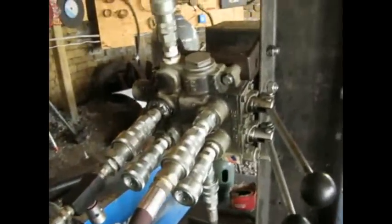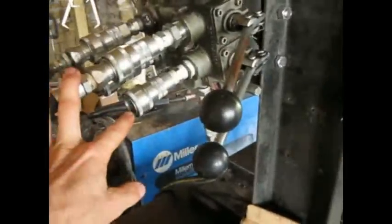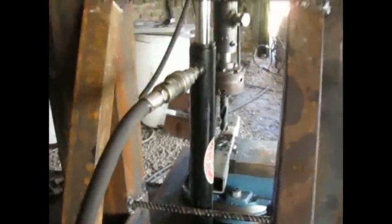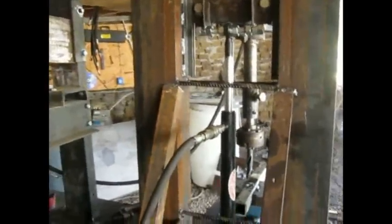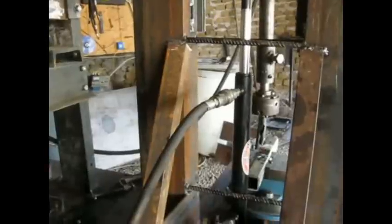The hydraulics are run from this valve. It's a system in series. We found out that if you have the system in parallel, coming out of the two valves, then upon the hydraulic cylinder being pressed down, it doesn't get a lot of pressure because all the fluid is going through the hydraulic motor. So we had to run this in series where the fluid goes through the motor first, and after that it goes into the cylinder so that the cylinder always has sufficient pressure.